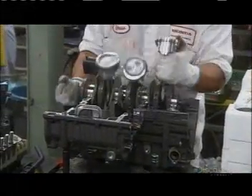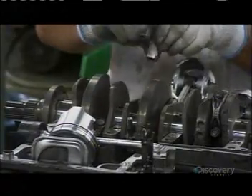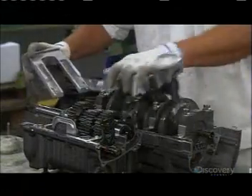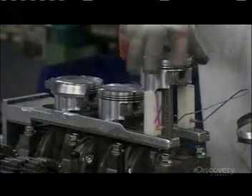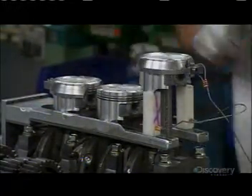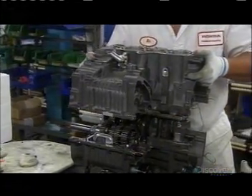They fit a crankshaft and pistons into the engine's left block. They tighten the bearings and caps, then slide in a U-shaped tool called a fork that orients the pistons in an upright position. They compress the piston rings with another tool so that the pistons easily slide into place as they install the other half of the engine block.